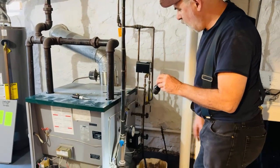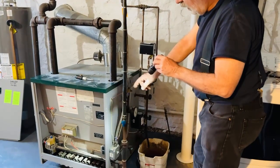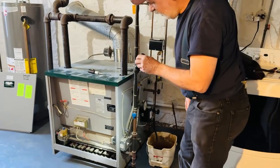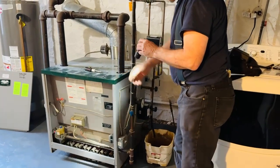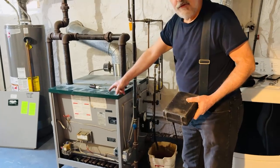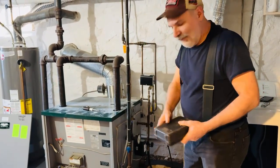There's about a 30-second delay on make. You heard a click and it should then fire. We have another issue here — I think we've got a little bit too much gas going in, we got a delayed ignition there, but that's looking okay. So we're going to check the gas pressure on the gas valve and make sure that's not set too hot. Great, thank you Gordon. You're welcome.